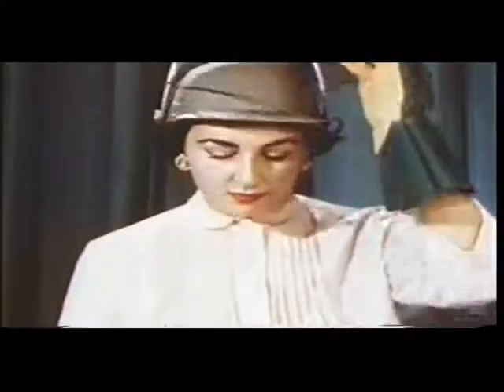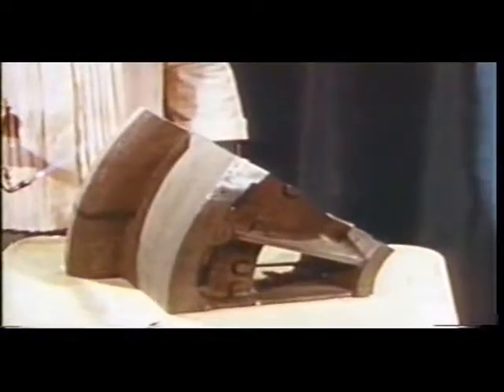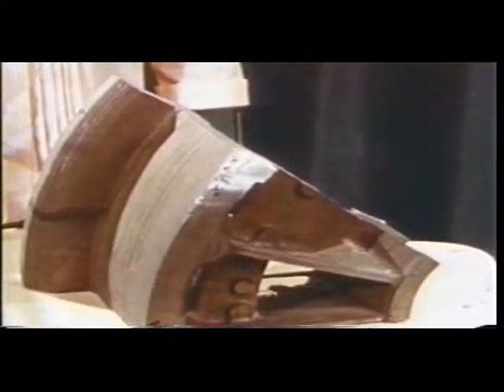Notice that Dorothy can melt and burn the sharp edges of the casting, but as soon as the torch moves on, any existing fire is self-extinguished. It just won't stay lit. The reason is that magnesium is such an excellent conductor of heat that the mass of the castings withdraws the heat of combustion, dropping the metal below the temperature of ignition.